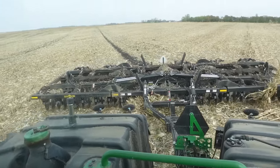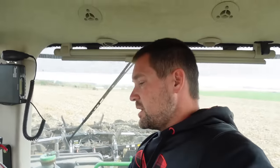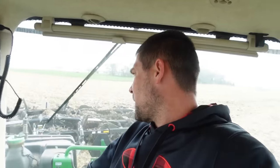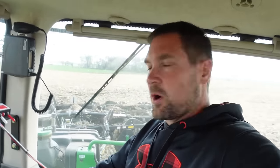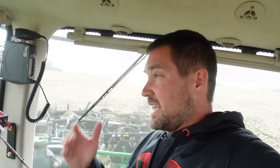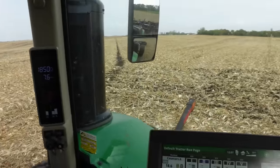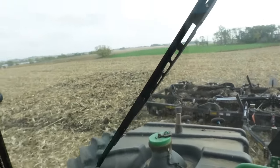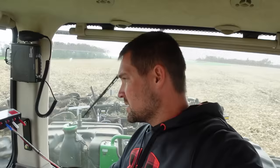There's a perfect example of what I'm struggling with. For a little bit I blamed the bent disc blade, but it's not that — it doesn't always do it in the same spot, it's kind of all over the board. It's just sticky soils. So we come back at the pile kind of sideways, drop it halfway down, and try to spread it out a little bit. Sometimes it works, sometimes it doesn't — sometimes you just end up with a pile in your field.